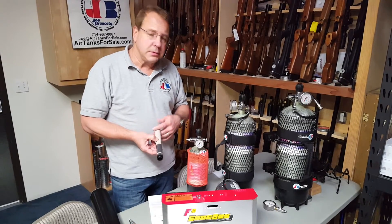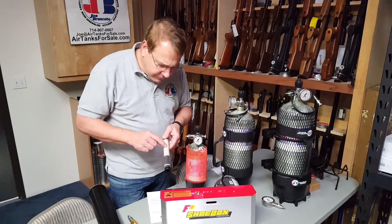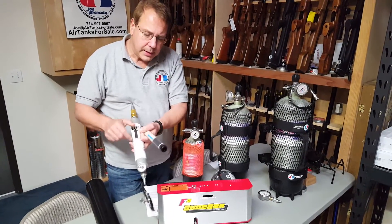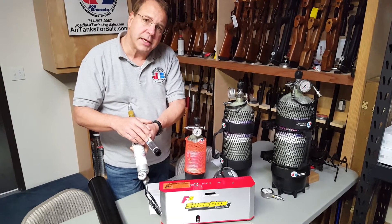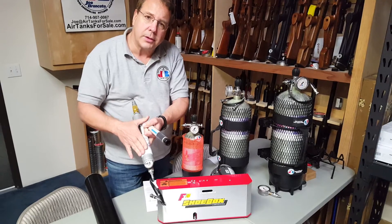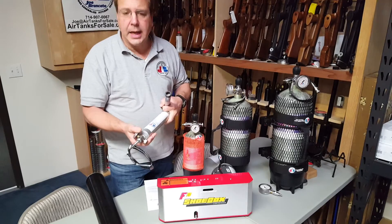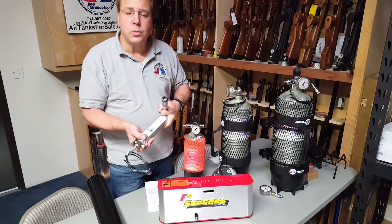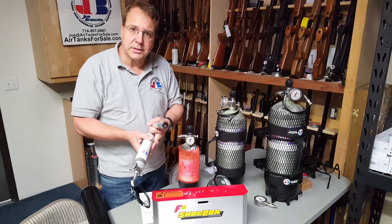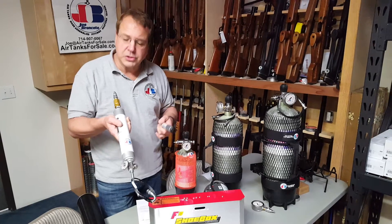You can't put the beads in there loosely. The other thing is never, ever have these beads come in contact with the aluminum surface. The reason is these beads leach acids once they get moist. At that point you have acid touching the metal pressure vessel, and that can eventually weaken the threads in that pressure vessel.